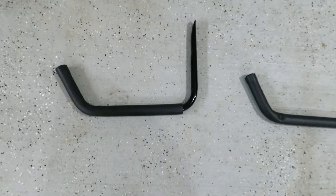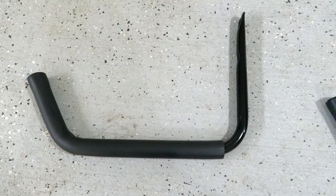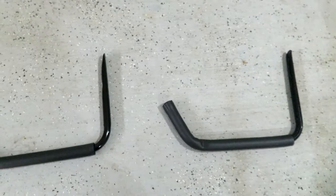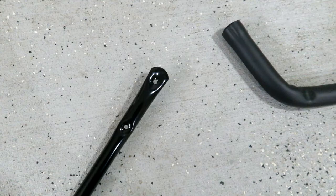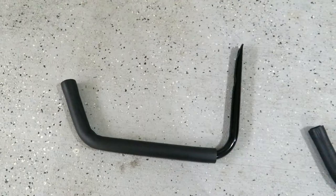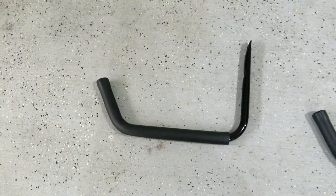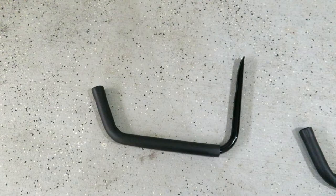These are the hangers I bought — they're basically like a J-hook, but the difference is they're padded. They have a bit of an angle so the kayak will rest in there nicely with a fairly wide gap at the bottom. I'll put a link down below for the actual model. It came with six hooks and I think I only need four. The key thing is it does provide hardware, but most people recommend using your own screws so you can get a good bite into a stud. I do not recommend installing these without screwing right into a stud — I can't see a drywall anchor holding these. The kayaks themselves weigh about 35 pounds.